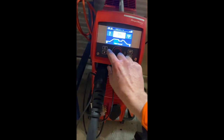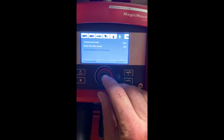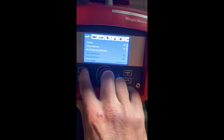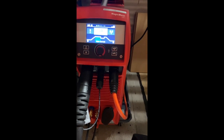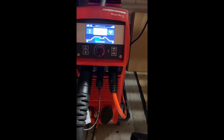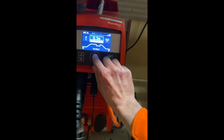It does take a while to start up this machine - it's alive and doing something. It should be in auto mode by default. You can see the cooling unit is on auto, which by the manual means it only starts up when I weld. Super quiet though - the cooling unit itself is quieter than the fans on most other welders that run all the time. This machine has on-demand fans, so you can be welding for hours without it making any noise at all, which is great rather than noisy fans running constantly.